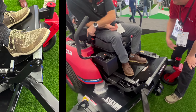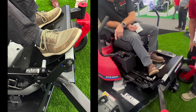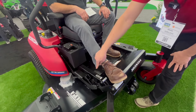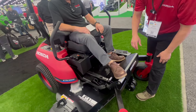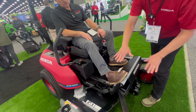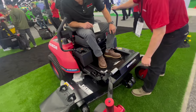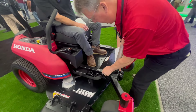How many settings on the deck? We go from 1.5 inch to 5 inch at 0.25 increments — standard height decks. This is a release. So we are at full up. If you put your foot and push this one, it will unlock the cam. Push this down and that'll lift the deck all the way up. To release it, you use the back of your foot to release the cam and drop the deck. And if you just want to lock it, push the first spindle down and it'll come up to a full lock. It's on setting three.